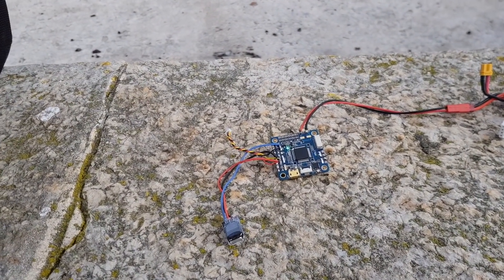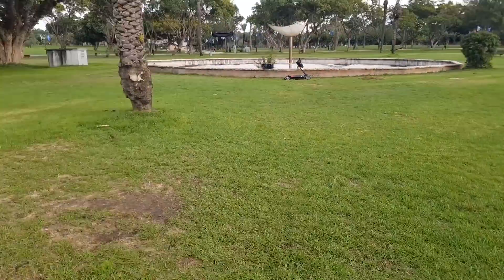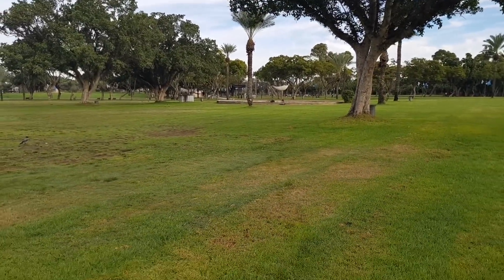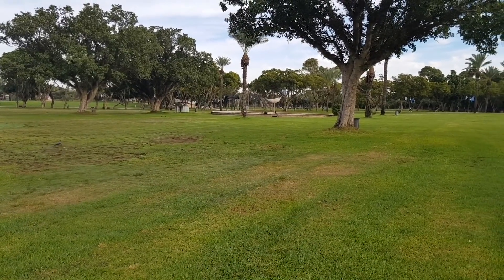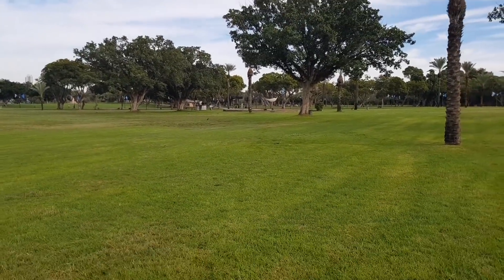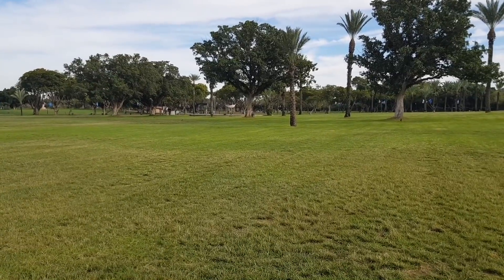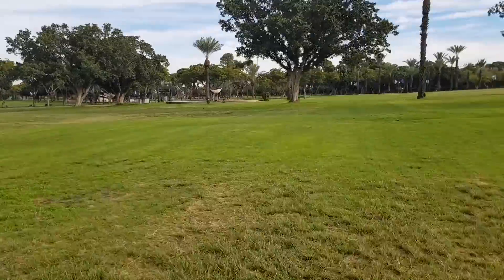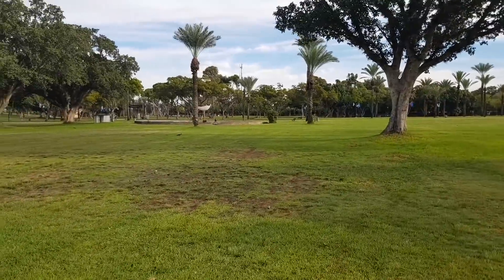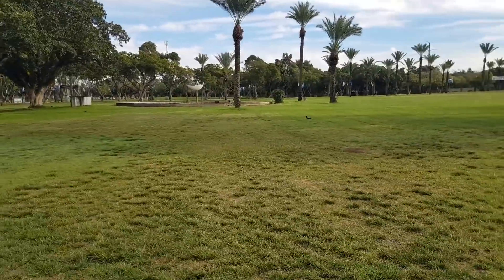The Hellgate FV is now plugged and I'm starting to walk away from the buzzer. At about 50 meters I can't really hear it anymore while moving, but when I stop I can still hear it. At around 100 meters I can't hear it anymore. Notably, the direction the buzzer faces matters — when it's facing me I can hear it, but moving to the side makes it much harder to hear, even at a closer distance.